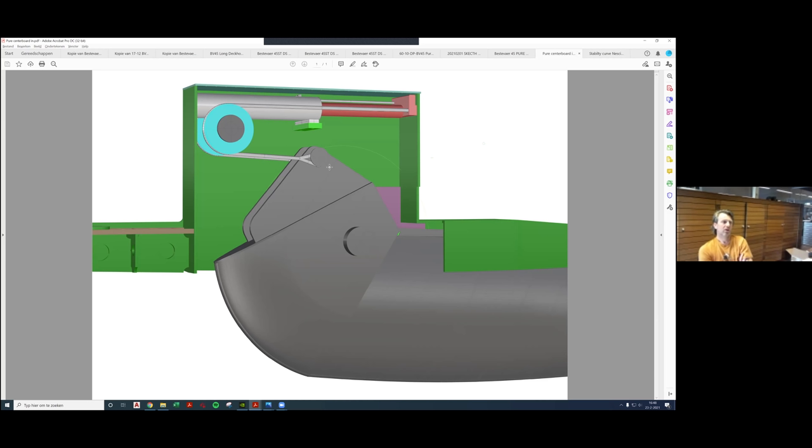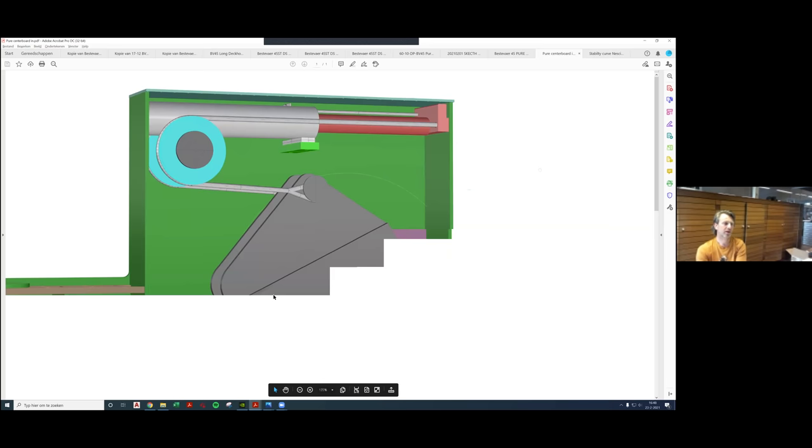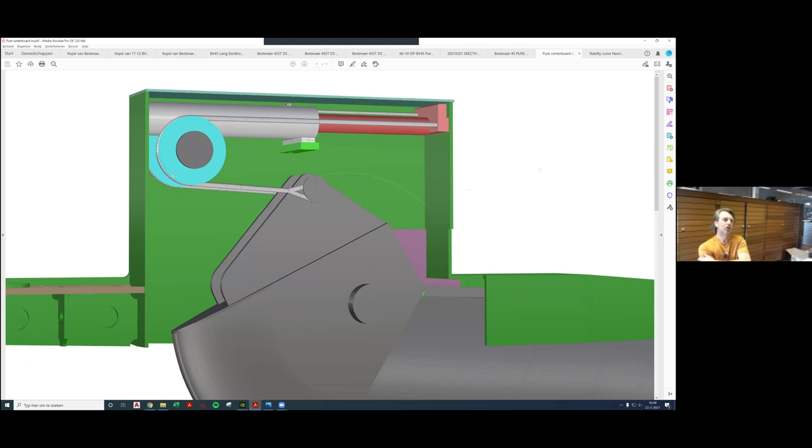You can take the top away. This is a top that you can bolt away, and the water line is somewhere here. So the cylinder is like 30, 40 centimeters above the water line. You can bolt off this aluminium plate, it's like a manhole. Then you can service the cylinder or check it, or if the line is damaged, you can replace it without taking the boat out of the water. Oh, that's a great advantage. Yeah, that's good.